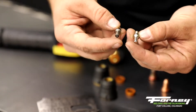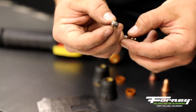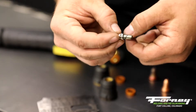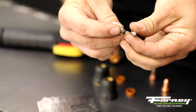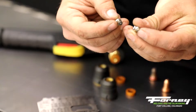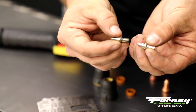These are two examples of the electrodes for our plasma cutters. This is the electrode we're going to be changing away from — you can see the swirl that is generated by the swirling air that goes through this machine, and you can see the start of the pitting on it. You can also see the hafnium in the end of this brand new electrode; that's what we're looking for when we go to switch out the electrodes.